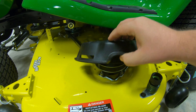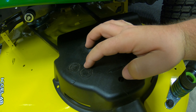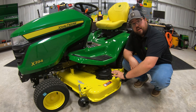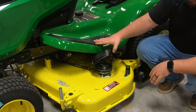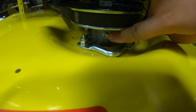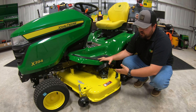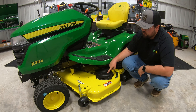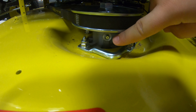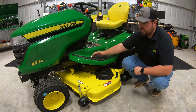As far as features on this deck, you have flip-up spindle covers that tell you right on top: use air, not water. When cleaning the top of this deck, make sure to use a blower or air hose — the less water on the mower, the better, since pulleys, belt, and spindles are exposed. The covers also indicate where your grease points are with a grease gun icon and arrow. The grease point is right underneath on the spindle — you'll have one in the middle and one on the right-hand side.